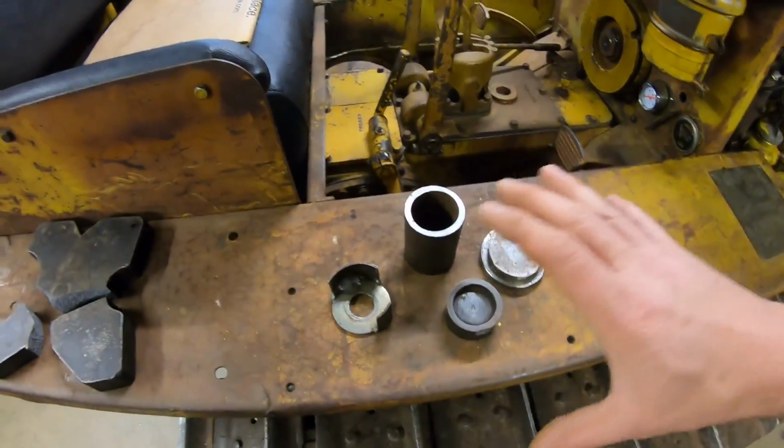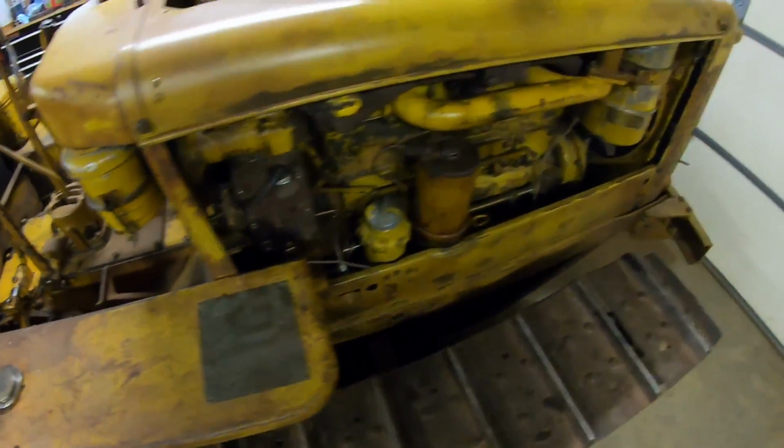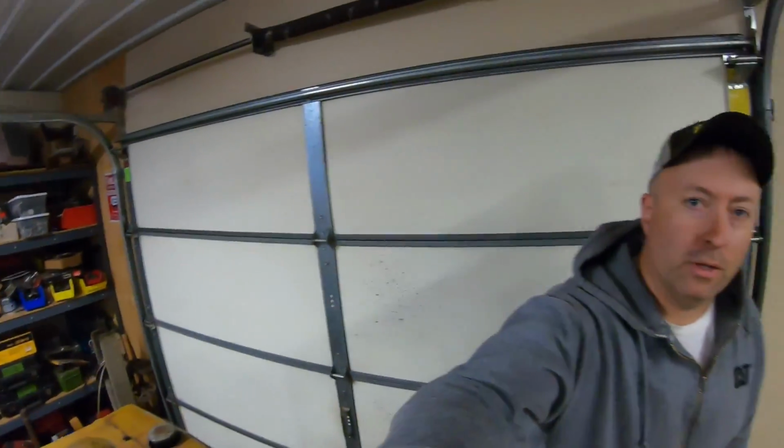All of my tools performed well, no problems. We didn't blow up any more pieces in the press, so pretty happy with how the job turned out. I have some retooling to do on the big track press because that's what I'm going to build the chains with. I need to redo the supports and the pushing adapters to put chains back together because it's only set up to press chains apart right now. So that's going to be some thinking and some fabrication. We'll get it figured out.